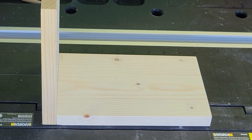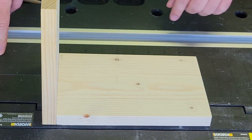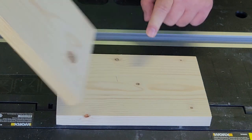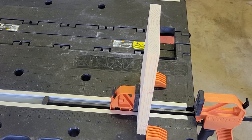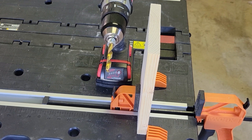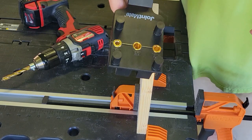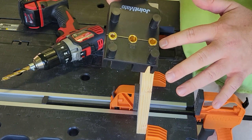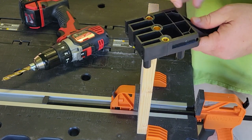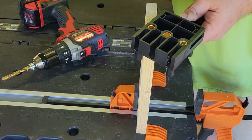We're going to do something wild and unheard of and go step by step with the instruction book. Step one says put the boards in their finished position and label them one and two. Step two is to clamp board one with the edge being joined facing up. We actually did step three earlier when we figured out where we should set the drill stop, but now is a good time to make sure this is good and tight and doesn't move back on you causing your hole to be deeper than you want it to. For step four, make sure you've got the hole you want to use. We're going to use these two pegs with a 5/16 inch bit. You just straddle the board like that and you can pre-mark out where you want the dowels to be, find your mark, and just hold it up tight against the board.